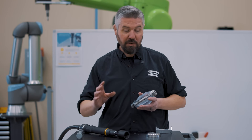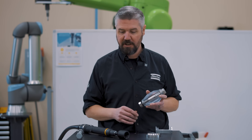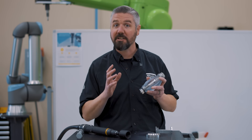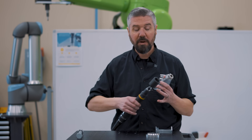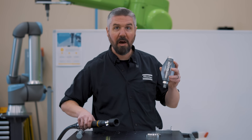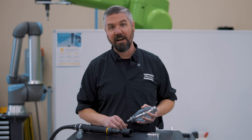So what's all this mean? We talked about the service load — it's super important to tighten the bolt to the correct amount of preload to handle the service load so the joint can stay together and never come loose. The relationship between torque and bolt tension is dependent on friction, so we have to be consistent with friction. If we adjust the torque setting to match the friction, we're going to develop the correct amount of bolt preload. We met our window of the right amount of bolt tension — this really demonstrates the importance of getting the right tightness and how to apply it with a power tool.